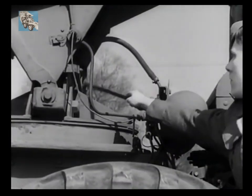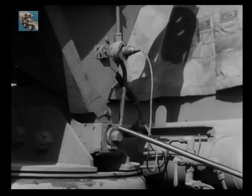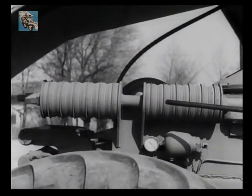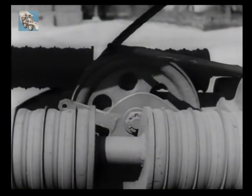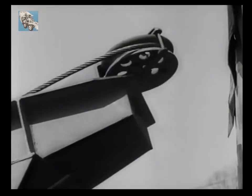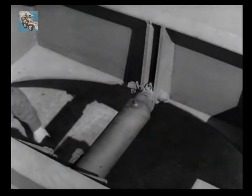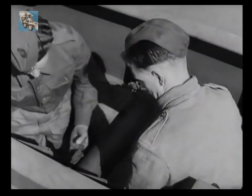These are the trailer air brake connections and the electrical junction, then the trailer retaining bolts, one on each side. This spring-loaded turntable allows the tractor to make a 90-degree turn, while these buffers compensate any lateral shock between tractor and trailer. The path of your winch cable is round this bottom pulley, through rollers, round the centre pulley and up round this top pulley, where the cable eye is shackled to the side of the frame. When separating or splitting the unit, the platform is supported by this single hydraulic jack, found in a central position at the front end of your platform.